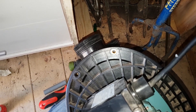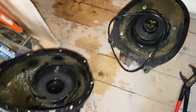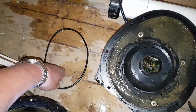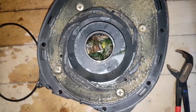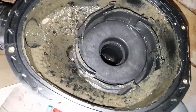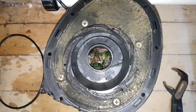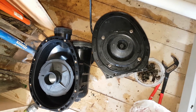We've got it in half — it's a rubber seal actually, so I've got to be very careful not to damage that. Let's give it a wash before we put it back. There's the problem: the center of the pump is blocked. I'm going to get all that cleaned out — there's plenty of sludge in it. That's the problem, that's why we're not moving a lot of water — it's blocked.